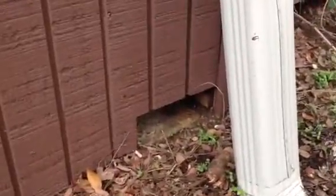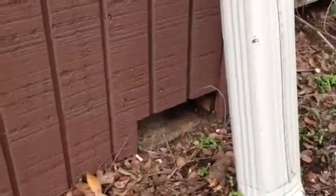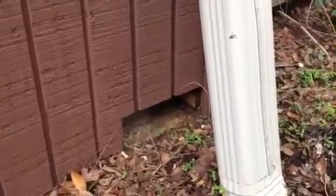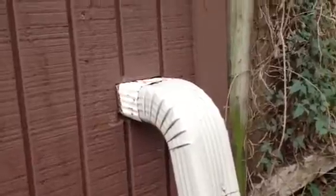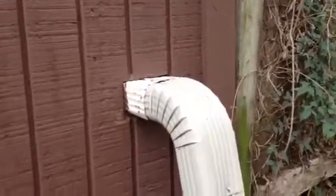There's a little runoff spillway right there — we're going to keep that, cutting a small notch to make sure water still has a chance to escape. You can also see the gutter downspout coming out here, which again we'll have to duplicate. Right at this corner is where we'll stop — no soffit, no fascia, just sidewall.